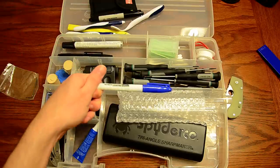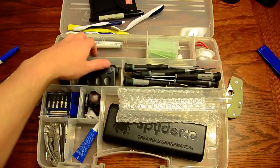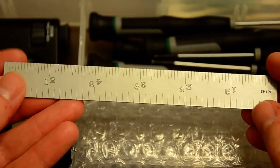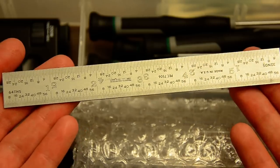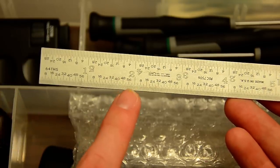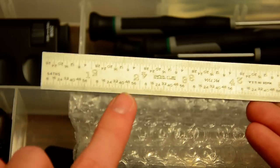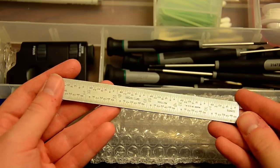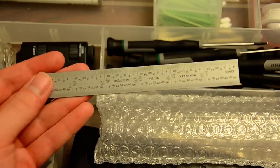I also have a gun bluing pen, a lens pen, and a little ruler. I'm not sure where to find these rulers, but if you can find one I recommend it. It does eighths, sixteenths, thirty-seconds, and sixty-fourths of an inch, and it's six inches long — perfect for measuring blade shapes. With that resolution, 64ths is pretty high for measuring in inches, so you can really see differences in blade lengths. I also use it as a straight edge to check if my Edge Pro stones are dished out — just lay it on the stone and if light comes through underneath, they need flattening.